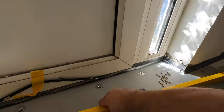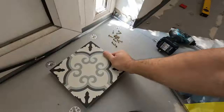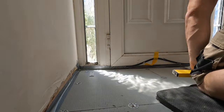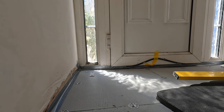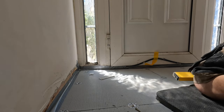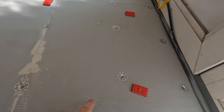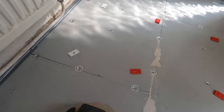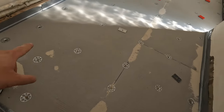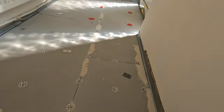I start with a 3mm packer here and then work my way in the other direction, finishing with zero by the door. When we pour the self-leveling compound we won't take it right up to the living room door — I'll make a pencil line and stop there. That section between where the self-leveling finishes and the zero point we'll just fill with tile adhesive. I understand this may be confusing but you'll understand when you see the images.